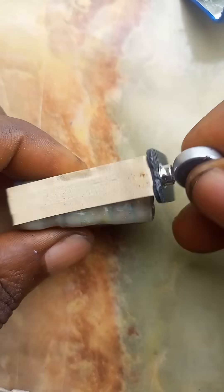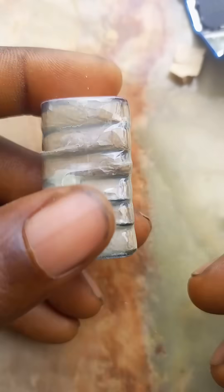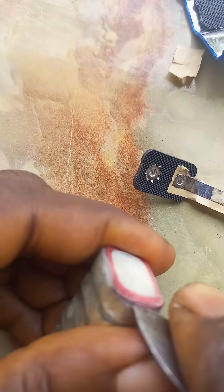Inside are six 1.5-volt zinc-carbon cells stacked on top of each other. These cells are joined in series, accounting for the overall high voltage. To increase the voltage of a battery, join them in series — the negative terminal of one side will be joined to the positive of the other, and vice versa. But while the voltage may increase, the current drops simultaneously, which is why they have extremely low capacity.